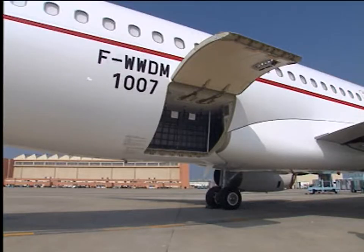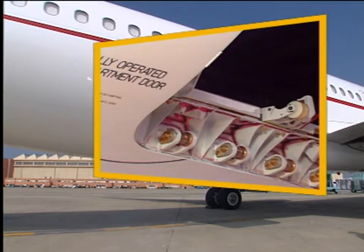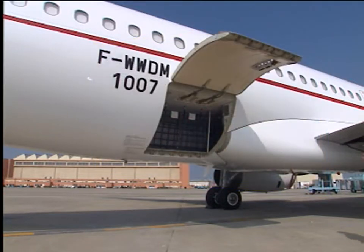Normal door closing. To close the cargo door hydraulically, if the cargo loading option is installed, make sure that the door sill latches are in the raised position and all required safeties are supplied.